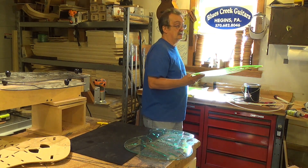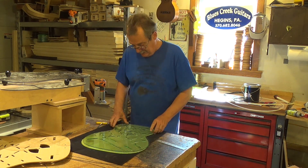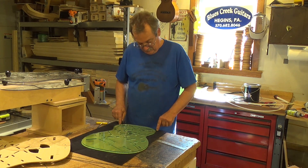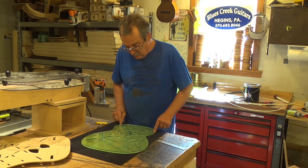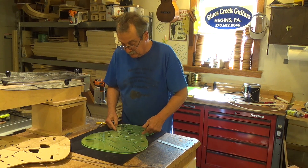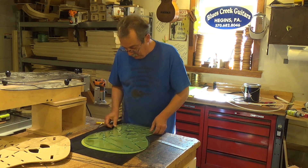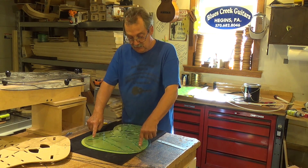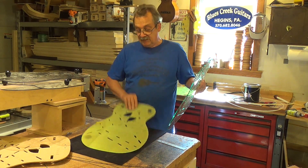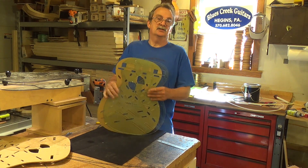This pattern here is from a 1931, and you can see the shape has changed — not much, but up here you can see in the shadows that this has changed. You can see the difference in the relationship of what happened to the braces — a forward and a rear type of shift, but you can see how the angles changed. This information came off of a modern guitar and this one came off of a 1931. So things through the years changed a little bit at Martin.